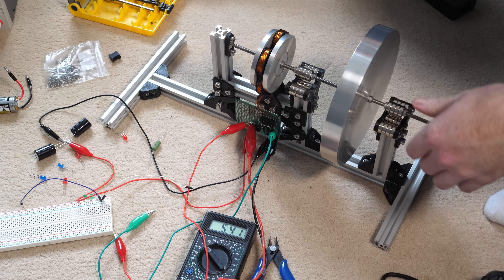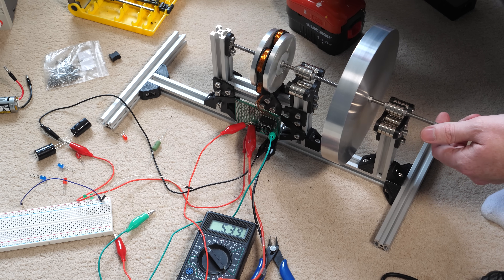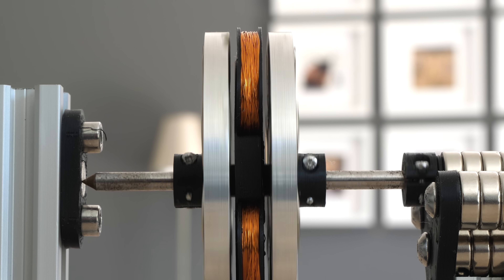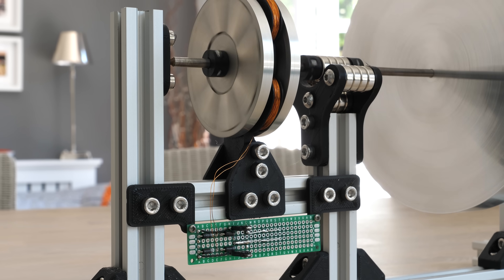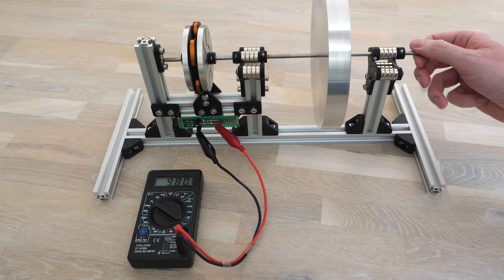But I don't really see much fun in requiring a drill to spin this thing up. It would be much cooler to have it as a desk toy that I can spin by hand and have it power something at much lower RPM. So to increase the voltage I rewound all the coils with much thinner wire so I could double the number of coils, then soldered together a new full bridge rectifier with slightly smaller diodes and larger capacitors. Now I can get nearly 10 volts when spinning it by hand.